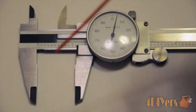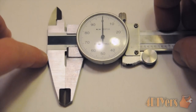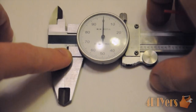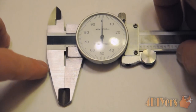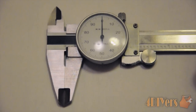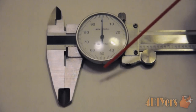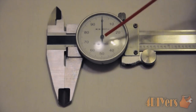When the jaws are fully closed, always make sure your unit is zeroed. You can rotate the dial back and forth to ensure it is zeroed all the way. When closing the jaws, always apply medium pressure and use the same pressure for every measurement to ensure accuracy. Normally, besides the slide lock, you will also have the dial ring locked at the bottom so it does not move when opening or closing the vernier.